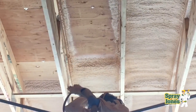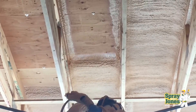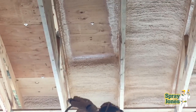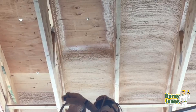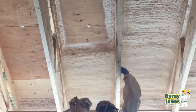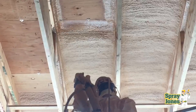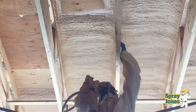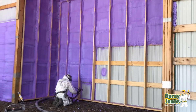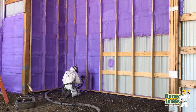So the question is: how much spray foam do you need over your metal or wood building to stop dripping? Can one inch of foam keep the substrate from reaching 6°C and becoming wet? Yes, absolutely — at 34–35% relative humidity it can. If you have nails, screws, brackets, or bolts on a metal building, you need to ensure you have a sufficient amount of foam over all of them — at least enough that they aren't a thermal short.